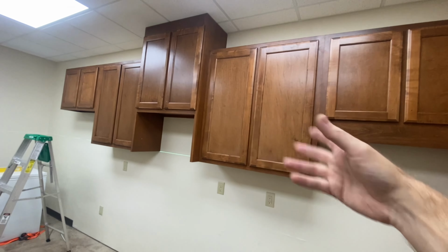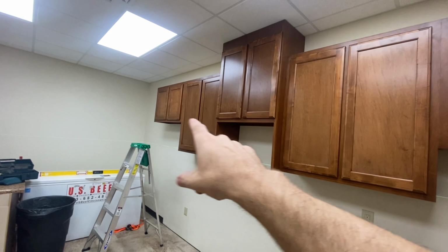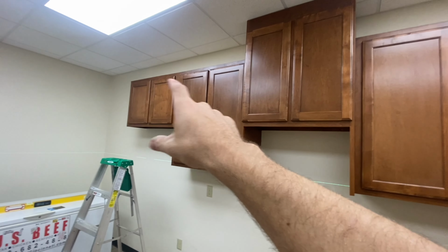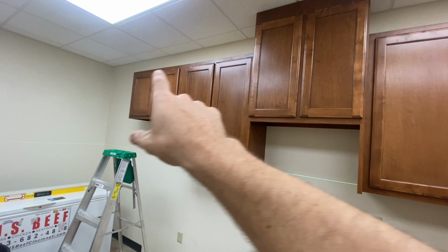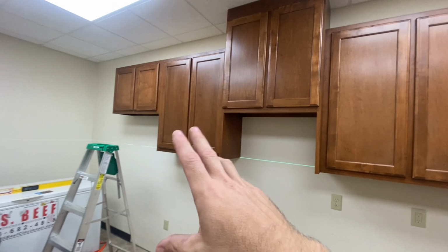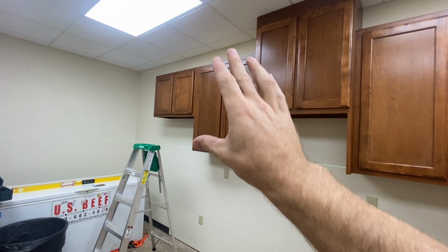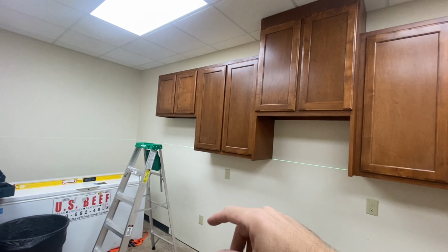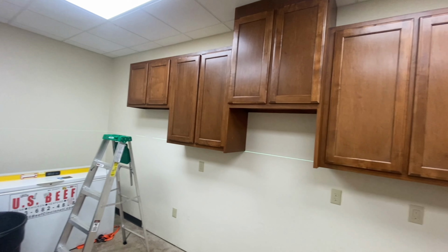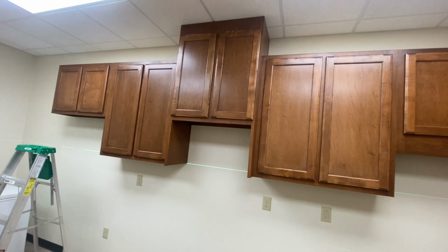And if you're a cabinet builder and installer, I'd suggest you look into doing that. So if you get into this situation, I think he just basically flips them upside down, puts the holes in so that it's whatever surface is going to be flush with one another. So that works out well. I think it's a huge time saver to not be on a ladder, having those special clamps, holding all those together exactly in the right spot, drilling the holes, screwing the holes, putting the fasteners in, all those things off of a ladder. Most of that work's already done, makes it a lot faster.